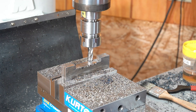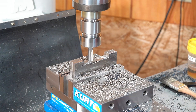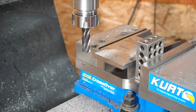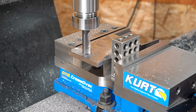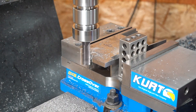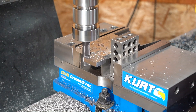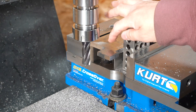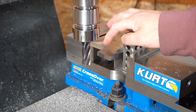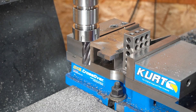We'll take the finishing cut with the carbide end mill. Let's machine out the corners. There's a lot of chatter when you get to the corner because you're touching a quarter of the circumference of the end mill — 90 degrees at the corner — so you just have to take it easy.